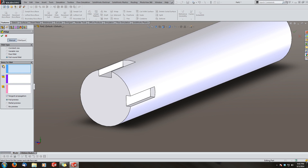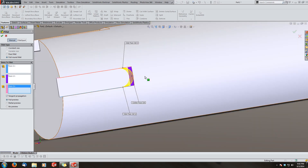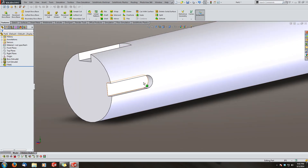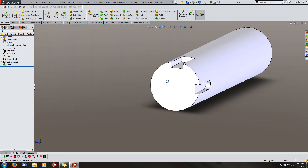The full round fillet shows you graphically which faces you need to pick. You grab surface one, click surface two, then click surface three and that gives you a full round. The nice thing is since there's no math involved and it's not constrained by a number, if I go back and grow this keyway to say a half inch it's going to maintain that full radius. Those are the two most basic keyways.